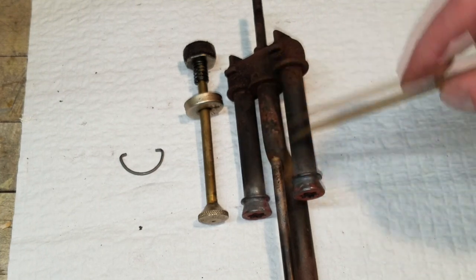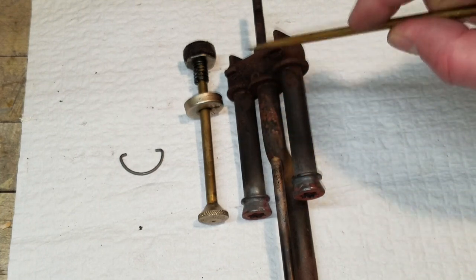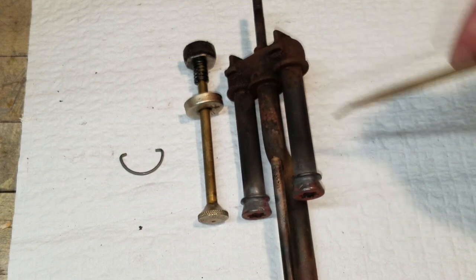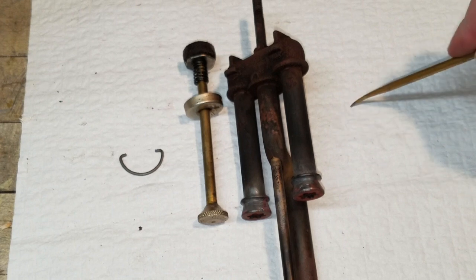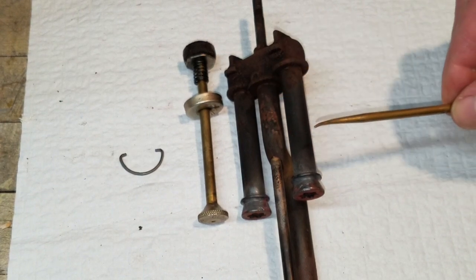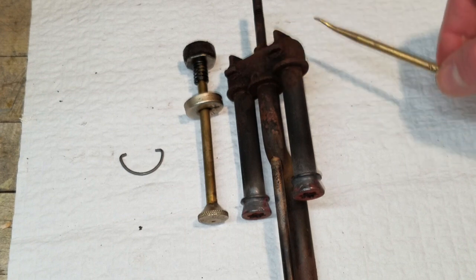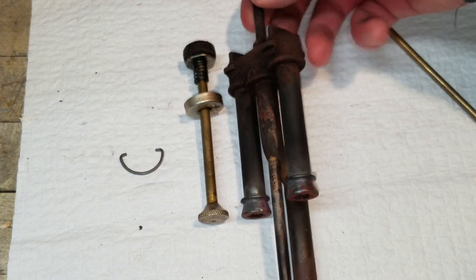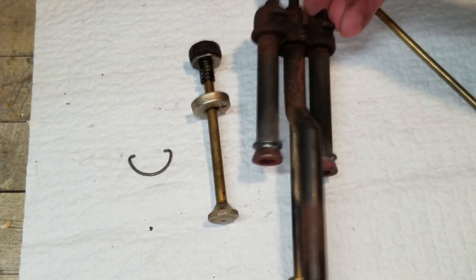These are all technically separate parts: air tube, mixer, and the burner tubes can be individually replaced. I think they're pretty hard to find. Most of the time, you just find the whole assembly, and for older ones, as far as I know, there's no one making new ones. You're going to have to get a used one that's in good shape.